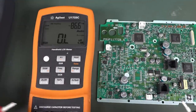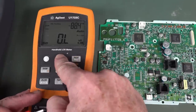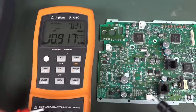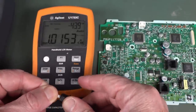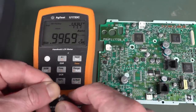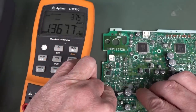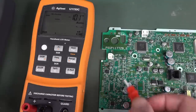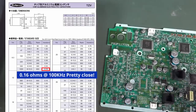It's practically bang on. We can also measure the equivalent series resistance of that capacitor, which is very important for high-frequency ripple applications. Let's put it in ESR mode. You measure ESR at 100 kilohertz — that's the general industry specification. We short the leads together to null them out. It looks like nulling isn't available in ESR mode on this Agilent meter. Calling that about 1 ohm, we now measure in circuit: 1.2 ohms. So we're under 0.2 ohms difference — that sounds pretty good for a 1,000 microfarad cap ESR.